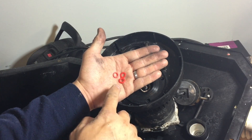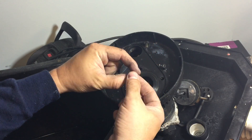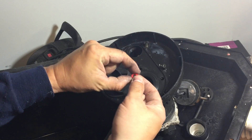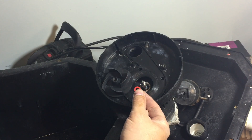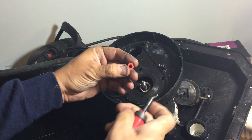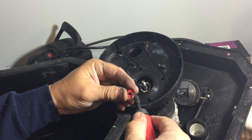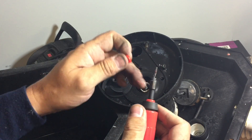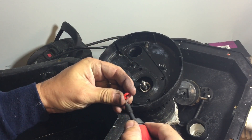I got my three washers — a 3 millimeter, a 2 millimeter, and a 1 millimeter. I'm going to use the 3 millimeter. It's looking good but is a little tight going on the shaft because when it prints it flattens out on one side. I just need to take my finishing tool and clean out that hole — just go around the inner edge. It's a finishing tool with a pivoting head, and it's great for cleaning this kind of thing out.